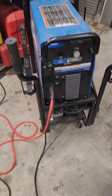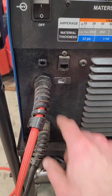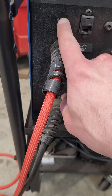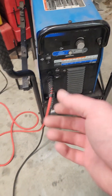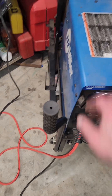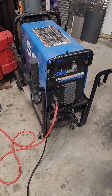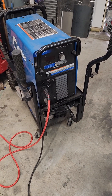One final tip: now that I've got it completely hooked up and tested it and it is working — I use the foot pedal plug here for the RJ45 connector to the foot pedal. This is where the old cable came out for the fingertip control. What I did was actually take the entire torch, disassemble it, pull the cable all the way back through, wind it up, zip tie it together, and lay it in the bottom of the machine inside in case I ever need to go back to that handle. Good luck with your Diversion 180 and thanks for watching.